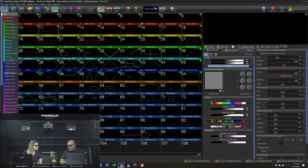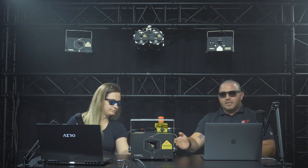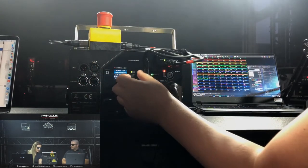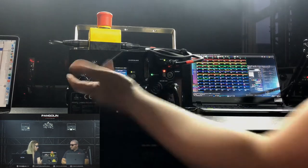A lot more lighting designers are getting into lasers. Over the past three to four years, we really dedicated a lot of development time to building out what we call our console mode setup, configuration, and control possibilities — really catering portions of the workflow to those of a lighting designer. You can connect directly to the projectors over DMX or Artnet. We have DMX 512, which is really standard, and we also have Artnet, so you can run Artnet directly to the projector and also daisy-chain it.